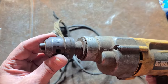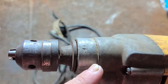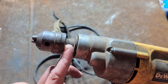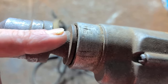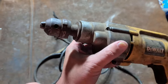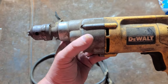One part will be how to deal with a chuck like this. Many times it will be rust on the spindle, and even if you can get a wrench in there you'll have to hit it so hard that you risk damaging the gears or cracking the gearbox. So this is going to involve cutting the chuck, measuring where the spindle stops, and cutting the chuck off — which is usually right about here. Then the hassle part is taking a grinder and making a slit on both sides so that you can use a chisel to split it and relieve all the pressure on the threads and remove it without risking damaging the gearbox.